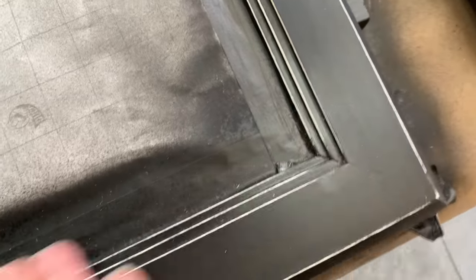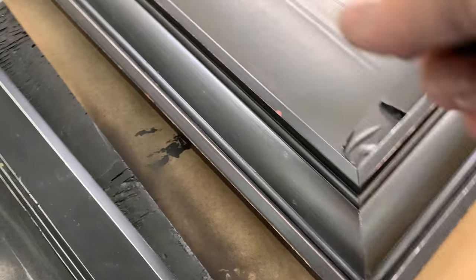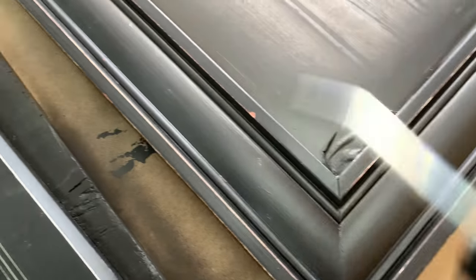But it still did a great job, even when I got to the steel wool to smooth the rest of the piece down to knock down that shine. Just to let you know, if you're going to switch over like I'm trying it out too, it's cost efficient. I'm going to go in with the air compressor and blow all that sanding dust that I created that was left behind before I move on to waxing.